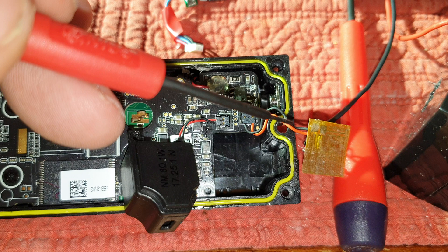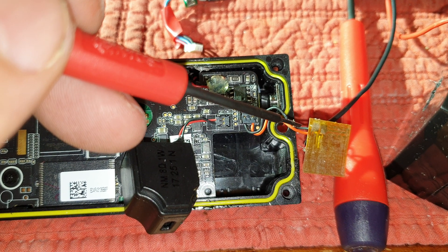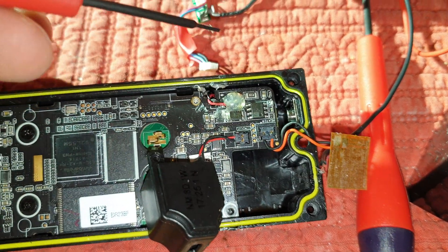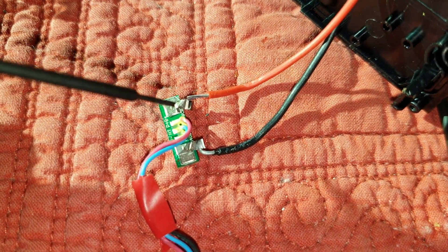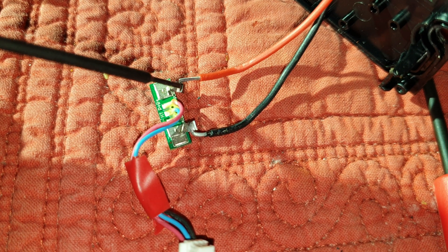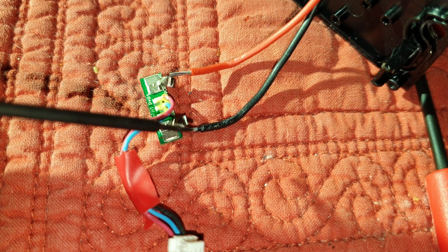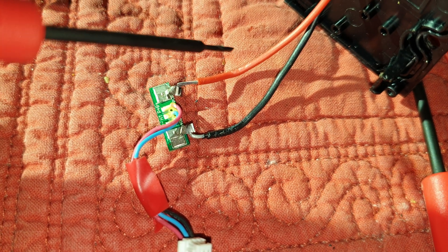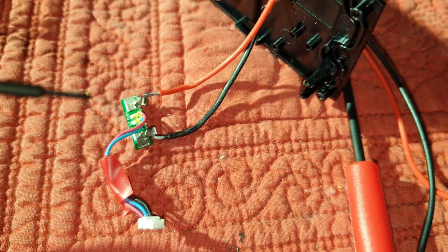Going back to the battery — it's dead. It's about a 300 milliamp battery. I took off the Wi-Fi antenna and controller, basically cut the prongs to the battery, connected the connectors, and soldered new wires to it, which are going to connect to the replacement battery.